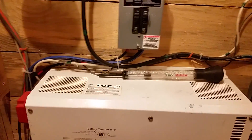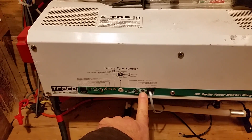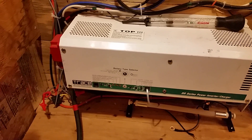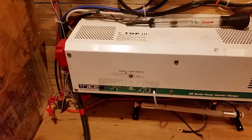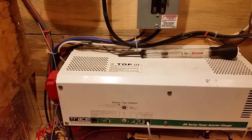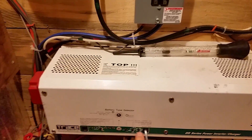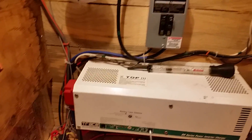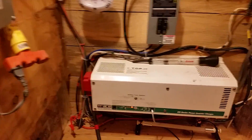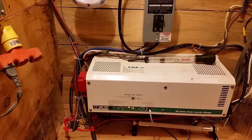The other thing I did is I turned the battery bank size pot down so that the return amps it was looking for would be less. Obviously a larger bank would go into float with a larger return amp. When you have a smaller battery bank, obviously the amps are going to be less when it's fully charged, so it uses that as an indicator for when it goes into float mode. Turning this all the way down is cheating a little bit — making the inverter think that it's not fully charged yet.